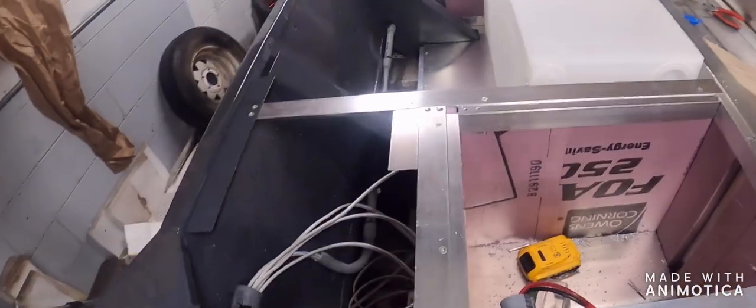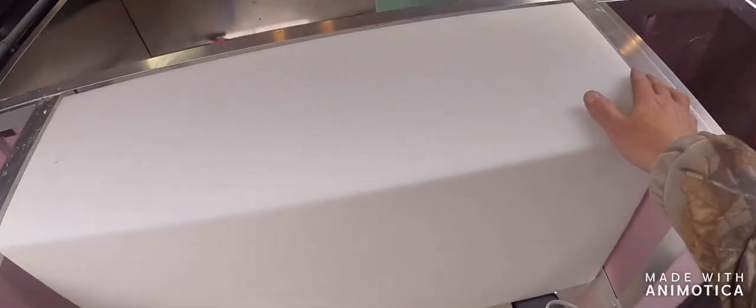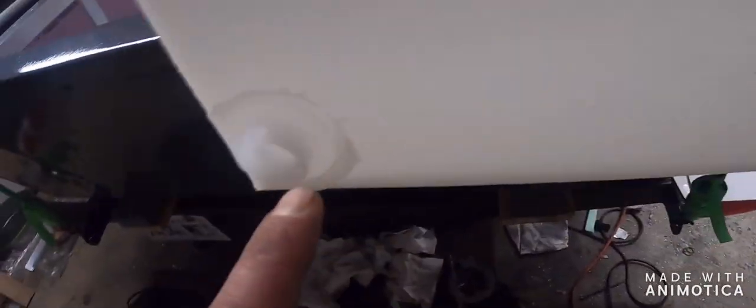Now the next thing is, I like to use these 30-gallon, I think they're made by Class A, they're RV water tanks. So, yeah, classacustoms.com. I get them off of Amazon. They're $53, and I think they're $21 shipping. These are sealed. These two are not. You can just go get a 3/4 PVC plug fitting, put some 5200 on it, put one in there, put one in here. Now you have a sealed tank.